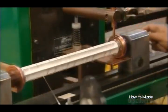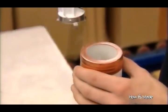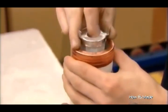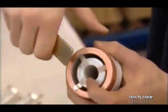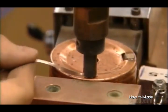This kind of high voltage fuse will be used in electrical substations. They slide the element core into the fuse casing and bend back metal taps. Then, using a soldering technique called brazing, they seal everything together.